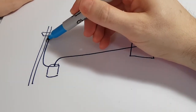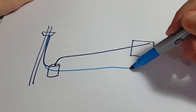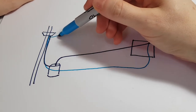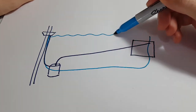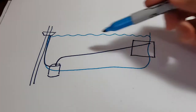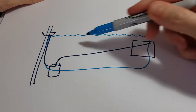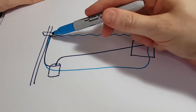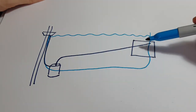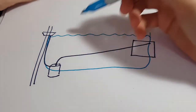So if you think about it as if it was a big bowl, and all we're doing is filling up the bowl with water — because the 1000 litre water tank is below the water line, or below where the hopper comes in, and the whole system is sealed, water will always flow down the pipe all the way along and up the other side, so the water tank will always fill. And that's how I make water go uphill without using a pump.